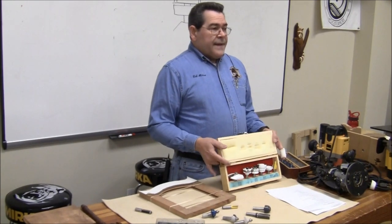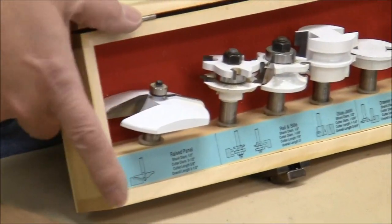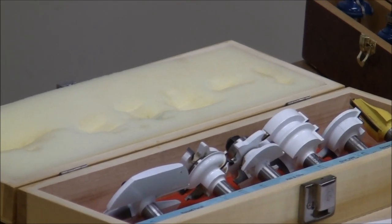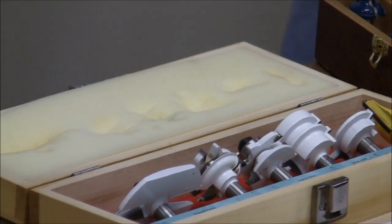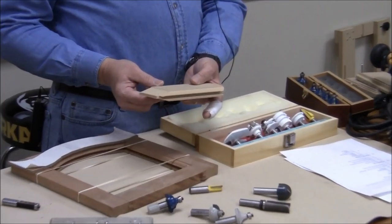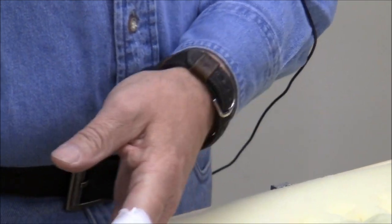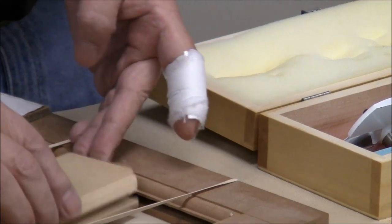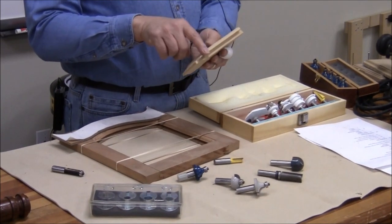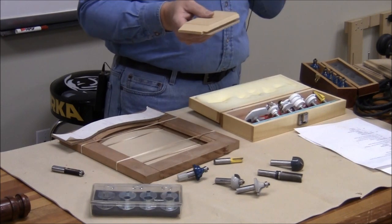While we're on the subject of bits, this is a door-making set. It includes a bit specifically for raising panels. This test piece has every cut you would make in making a raised panel door. At one end it has the actual raised panel relieved in the back, narrowed down to a quarter inch to fit into a slot in the panel. There is a cutter that cuts the end of each rail, and then there's the other cutter that makes the surface on the rails and the stiles. So those three bits are what are used to make this piece.